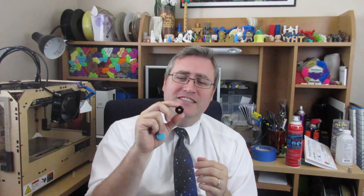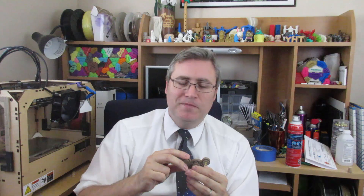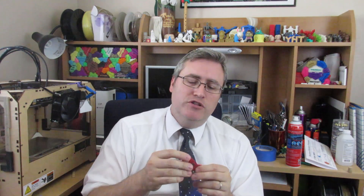Near the end of that video, I discovered that the bearings I was using on the side — this triple-shelled bearing that I still don't know who made or where I downloaded it from — turns out to be a fairly effective bearing. I think the double shell, where it has two opportunities to roll, just works out great. I thought it would do more rubbing than rolling, but it works great as a bearing. I also discovered that a weighted bearing printed out with bronze fill actually spins better. I don't know if that's because the particular filament rubbing against itself does a better job, or if it's actually a function of the weight, but I assumed the weight had something to do with it.